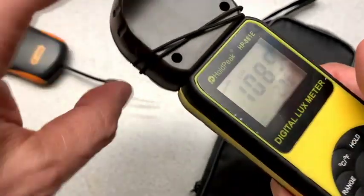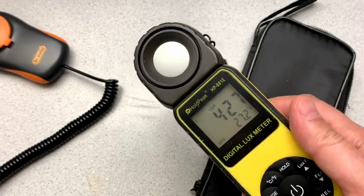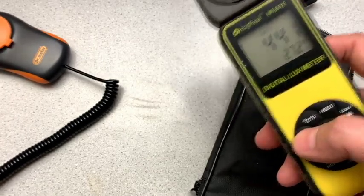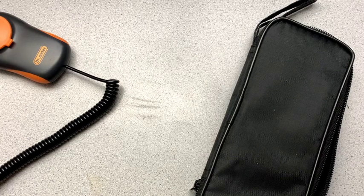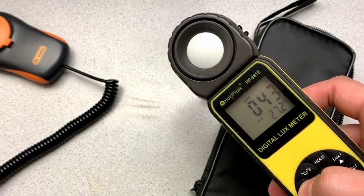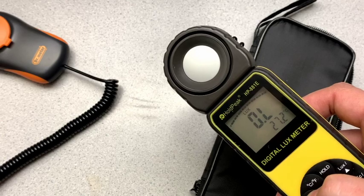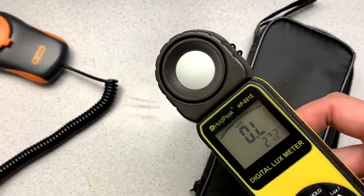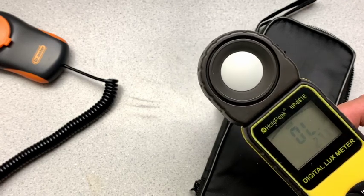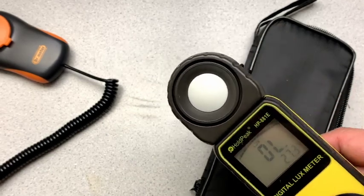I'm not exactly sure how useful that is. If I get it super bright here — maybe you can see that. But I like that it's auto-ranging, because it's always irritating with these manual range things. Once they kind of hit their peak you don't get anything anymore — you've got to figure out how to get it to the right range. You know, that's whatever the reading is times 10 and times 100. And I'm not exactly sure what this range is all about — it's probably tenths of a lux and hundredths of a lux. So we're way over here. So this can be used to measure some very, very small amounts of light. And you can see that it's showing over range at this point.